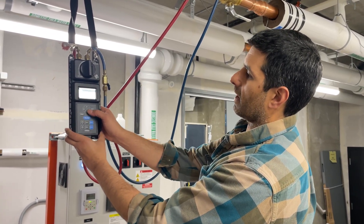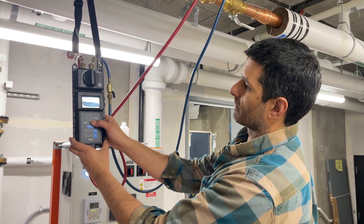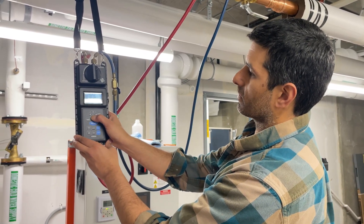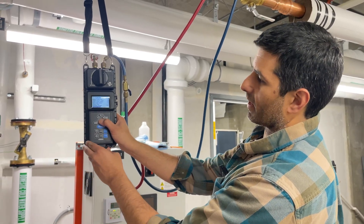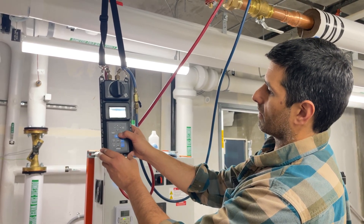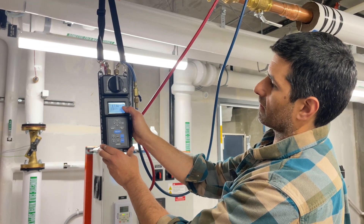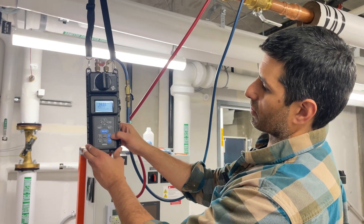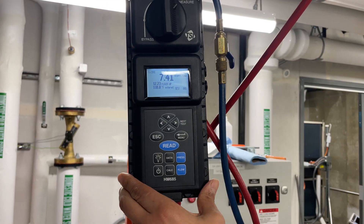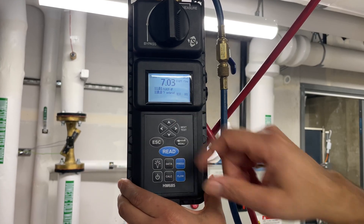It's already been set. The name of the Cv value — you can have multiple ones programmed — the fluid which is water, and the temperature which I know is about 118 degrees. The device has the ability to convert that Cv value and these other variables to flow. So we go back, and we see the differential pressure. We're going to switch from pressure mode to flow mode, and now it's indicating US gpm flow. It also reports the differential pressure and the temperature we've entered.